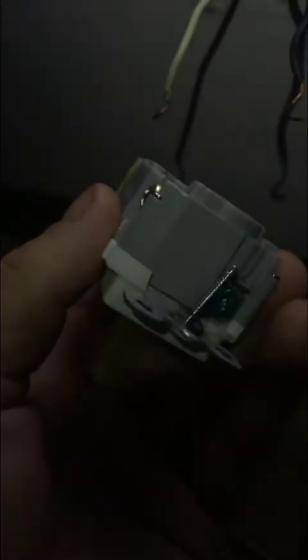We determined that the bottom two wires are our line — our hot line and our neutral line. You can see where it says 'line' on the outlet, and these outlets usually come with a yellow piece of tape over the load section. I'm going to attach the wires, wrap them around the screws and tighten them down with a screwdriver. If you have a ground wire you would tighten it there, but we don't have a ground on this unfortunately, so we're not going to start ripping out walls — we'll go with the next best thing and upgrade to these safer GFCI outlets.